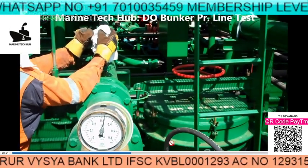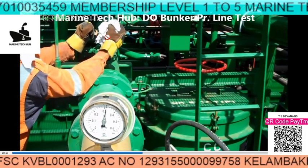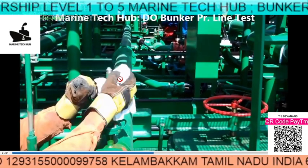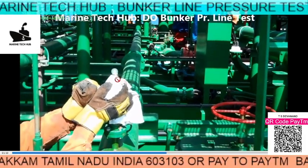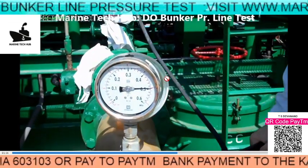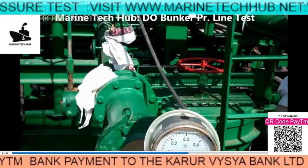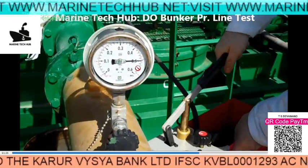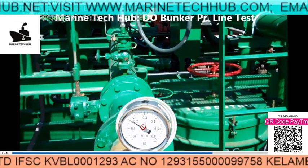Afterwards, connect the hydraulic line into the system here — similar to what I explained for the HFO bunker. You can see the air bubble and diesel coming out. I am crack-opening it so that it does not splash diesel oil everywhere. Once you get the oil, connect the hose and fill in diesel oil here. Start pumping. The pressure has almost come to 5 bar, as you can see. Once the pressure reaches 5 bar, keep it for 20 minutes, then depressurize the line.